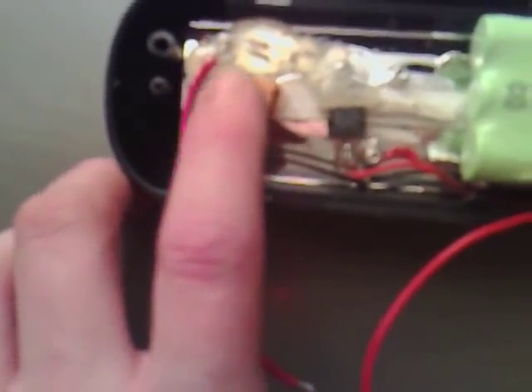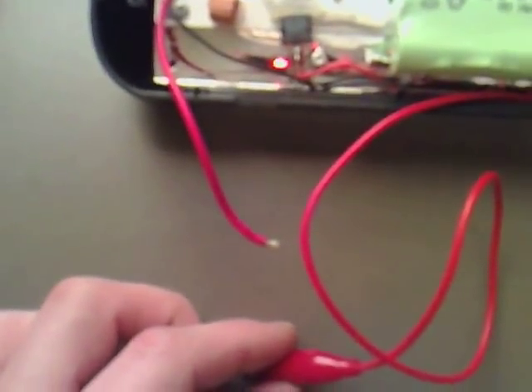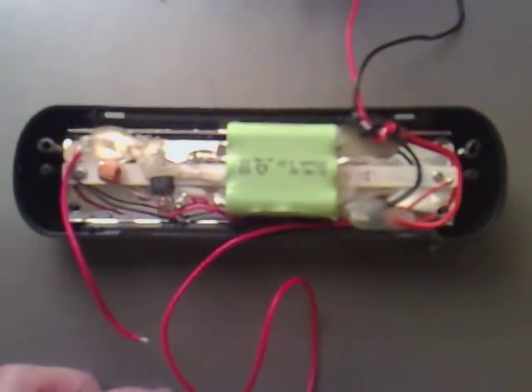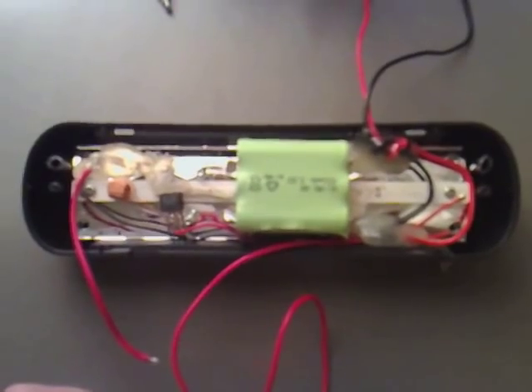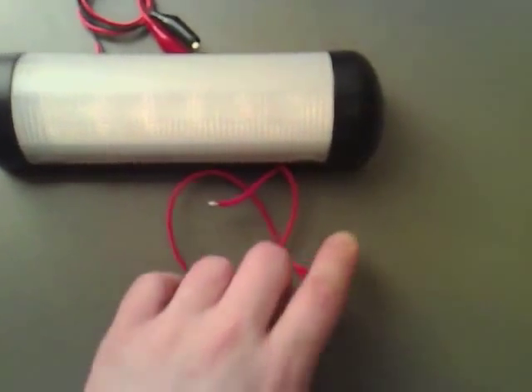What I've got here is almost a finished product. I've glued the coil in, I've encased the resistor there so it won't catch on anything, the transistor has been glued on, I've glued the battery in place, I've glued the diode — the charging diode — and the two charging leads that come out, so when it's in operation you can touch these two together and it doesn't short out the light. I've just got the switch left to do. I've got the light now with the charger leads coming out and this is going to be our on-off switch for now.